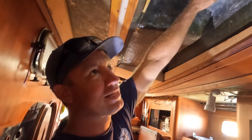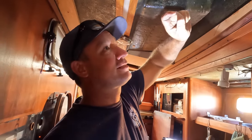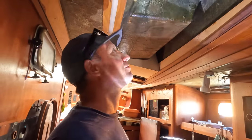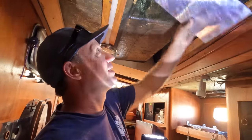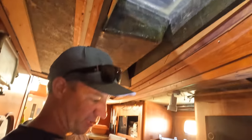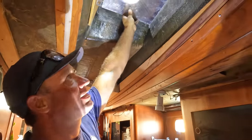There's our patch from a couple of weeks ago - we replaced that with G10, it's solid glass board behind there and I've just glassed it all in. There's our holes for the winch up there. It probably doesn't need a backing plate - this was originally glassed over ply or balsa, and we removed all that and filled it with solid G10, which is just solid glass board. Super expensive, super strong - we got an offcut really cheap. There's a big sheet of ally that's a backing plate, so I might just make an epoxy bed and put that in. This winch is not going to come loose - once that's bedded and dried I'll drill the holes and we'll mount our winch.